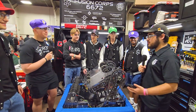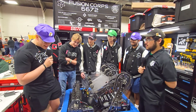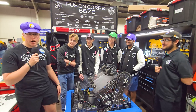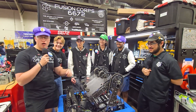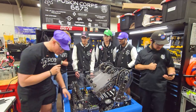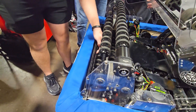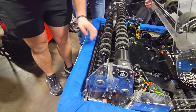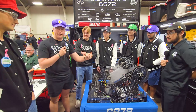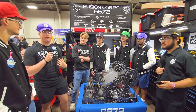Talk to me about your steel bracing. Yeah, so we actually incorporated steel bracing into our robot this year. We took a lot of inspiration from Team 148 last year with their smash-into-the-wall strategy. They hit the wall extremely fast and we wanted to be able to do that at the source this year. So we integrated 14 pounds of steel ballast into our front frame to ensure that it never bends once we're hitting the source, allowing for optimized cycles — max speed going in and max speed going out.